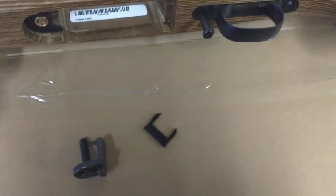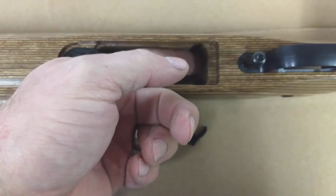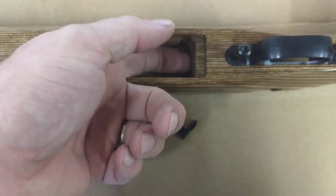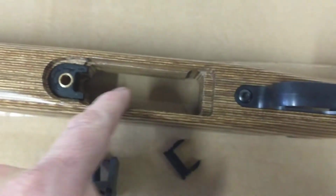So essentially, yes, this does need its own upgrade kit. It's going to come with a mild steel part, and I'll include the CA glue. That's all this is held in with, a little cyanoacrylate type glue, to hold this plate in the back, the catch for the tab on the rear of the magazine, to retain the rear.